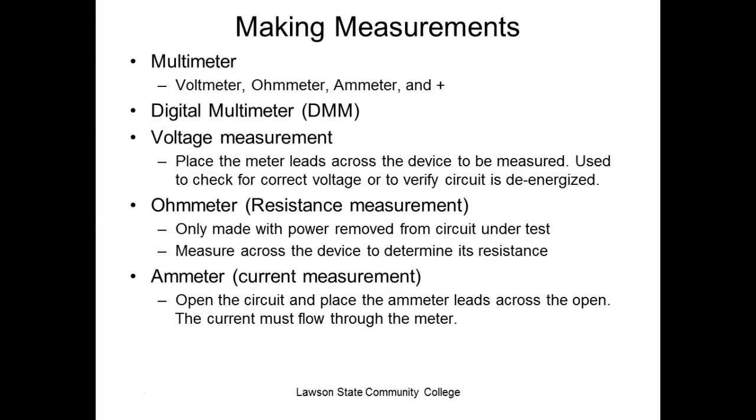You understand that? Another thing that a lot of people don't understand is you're supposed to disconnect all sources of power. And what are our 3 sources of power? Electrical, pneumatic, hydraulic. So if we've got pneumatic or hydraulic systems, we need to make sure those are disconnected. And we're also supposed to get rid of all stored voltages, all stored pressures.